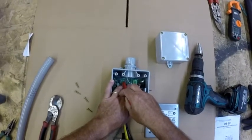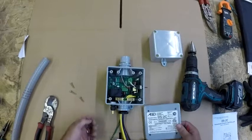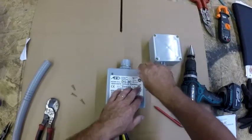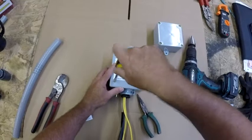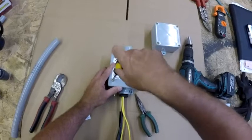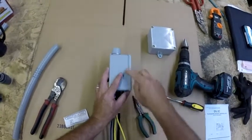Do not adjust any of the factory settings for the thermostat or any of the delays. The delays have been turned off and the thermostat should be left preset at about 38–39 degrees. Replace the cover and tighten down all the screws, but do not over-tighten them — that will warp the cover and may allow water to infiltrate into the box, which could void the warranty. Just snug them up.